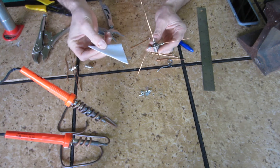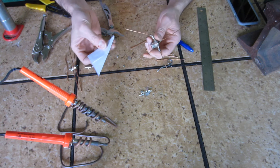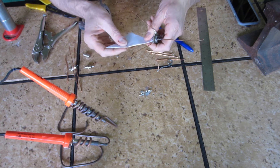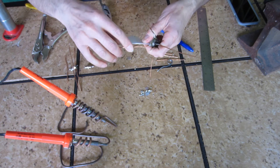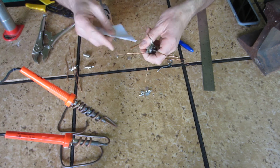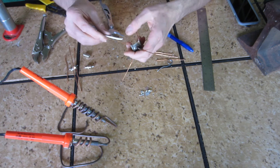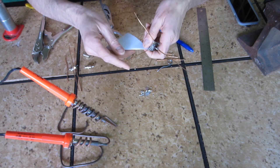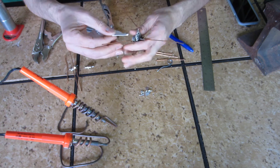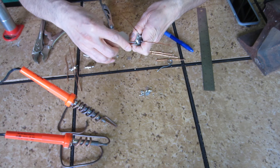A quick and dirty way to do that is to make a piece of paper that's perfectly square and fold it diagonally across two of the corners — kind of like you make those footballs when you're a kid — and you've got a 45 degree angle. Just line it up with the radial and bend it down, so it's pretty much parallel. A 45 degree angle is going to give you roughly a 50 ohm impedance. The farther down you bend it, the closer it'll get to 70 until you have a dipole, basically. If you bend them all straight down you'll have a dipole; if you keep them flat I think it's something like 30 ohms. Continue on around, bend the next one down — pretty quick and easy to do. You can tweak them a little bit and you'll be done.